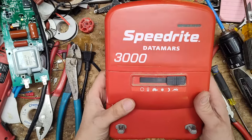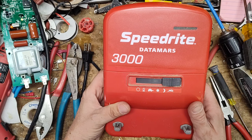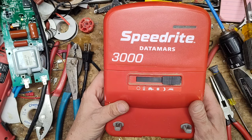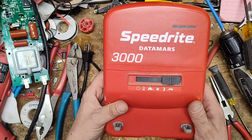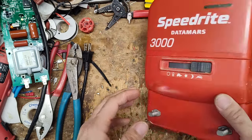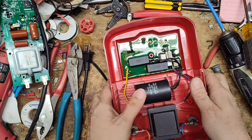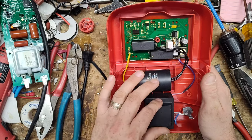They are an AC/DC model — run off either 120 volts or 12 volts. The downside of the 12-volt option is that some people use this on a solar or 12-volt setup outside, which is fine, but these are not a sealed unit. Water can get inside, and when water gets inside, it can short stuff out.